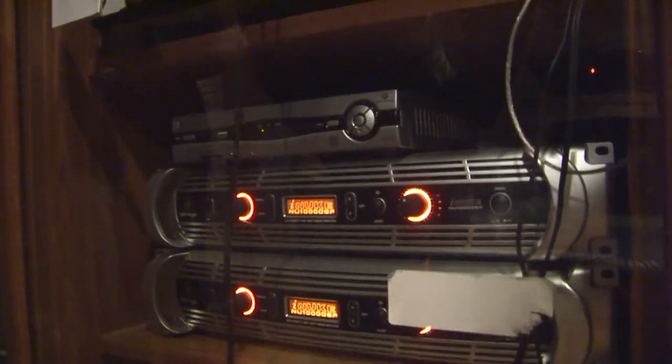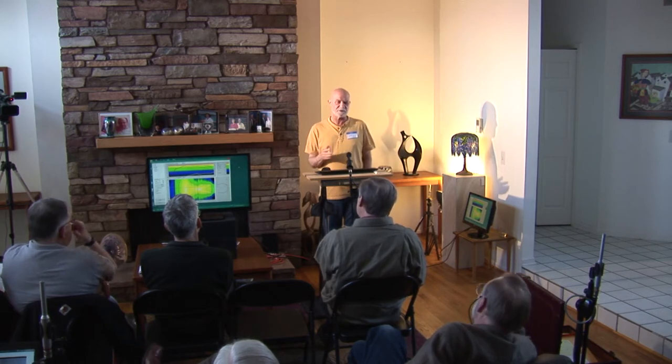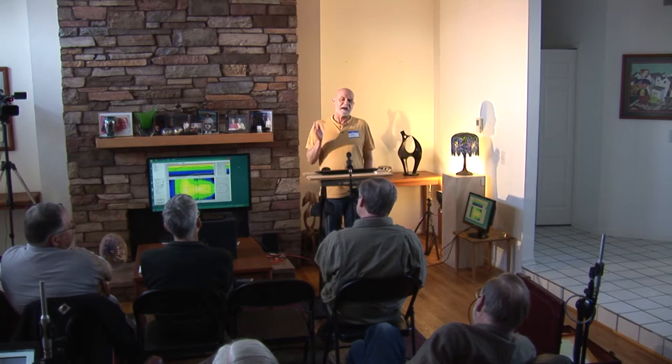I was stuck trying to figure out how to make this thing work. I ended up buying a bunch of external amplifiers and doing all of the electronic crossover externally — two Behringer class D amps that I think work pretty well. They weigh almost nothing, are very inexpensive, and the DSP works fairly well. However, they're missing one feature I wanted: a delay, because I wanted to try flattening the phase response in addition to amplitude response. You can't do that with normal minimum-phase filters — it takes an all-pass filter. The Behringers won't do that.